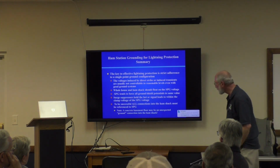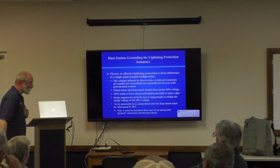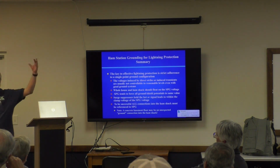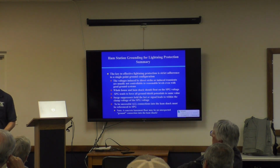You'll be perfect. Note, a concrete basement floor may be an unexpected ground connection into the ham shack. We're talking about getting rid of all parasitic ground connections into your home. Remember that your floor could be a problem when wet particularly. I don't mean wet like water on the floor, I mean damp. Damp concrete is something that will conduct.